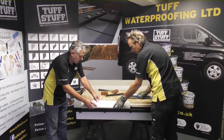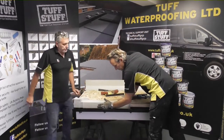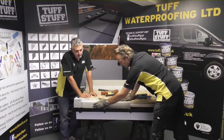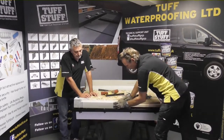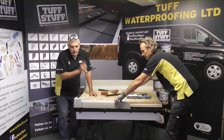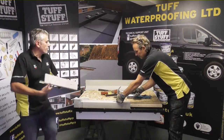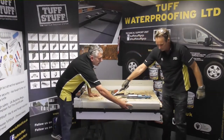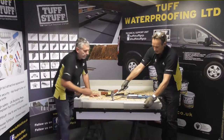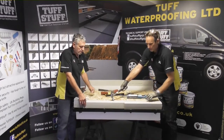Roll that up and over, and I'd suggest the best way of doing this is just to wipe that onto your batten. Lean over and wipe that onto your batten, and then get your clout nails. Let's just make sure we've got that in the right position because we're looking for 75mm to 100mm overlap on those trims. Lightly pin it, stand back — even ask someone in the garden looking up — making sure that everything's nice and plumb and straight.